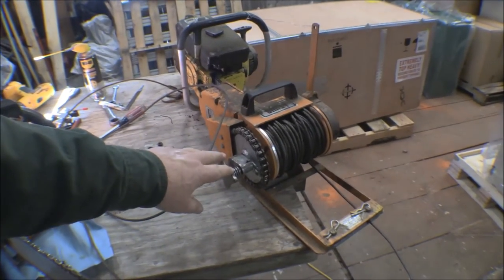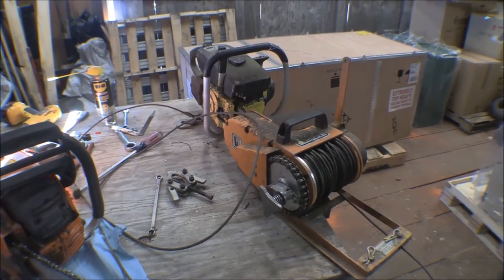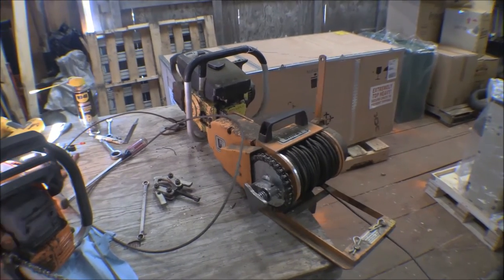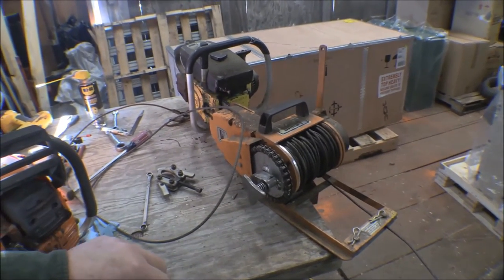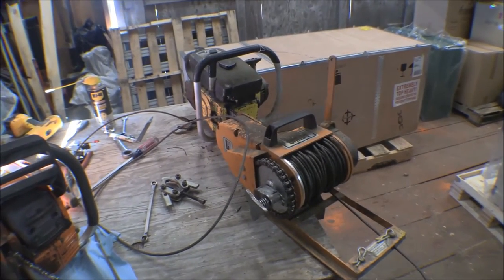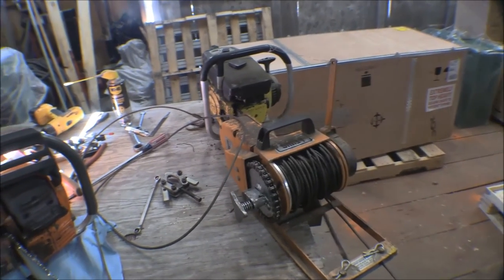You have to be careful — if you pull with the full power of the saw, it'll shear that pin and tear the winch up. But otherwise the winch works really good. I've pulled out some pretty big logs with it. You get too much pull on it, like a moose coming through the muskeg, and it just pulls right along. You put a block on something and double the line back on it, and it's amazing what it'll pull.